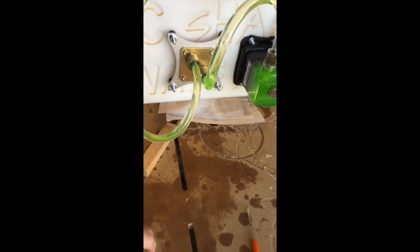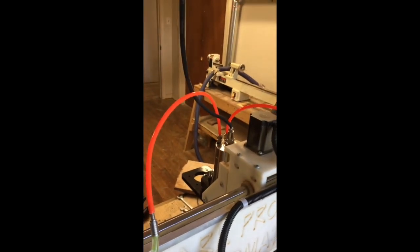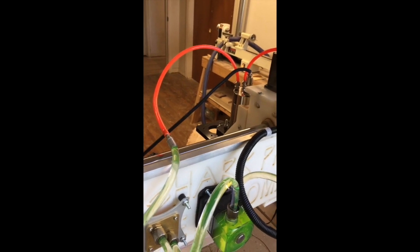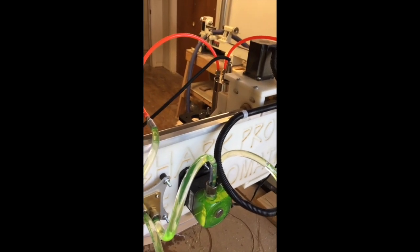The spindle motor is on and running at 23,000 RPM. I'll dress it up by hanging these two hoses with a bungee cord from a ceiling hook. Note that the spindle driver cord should not be bundled with the stepper motor cables because the spindle and stepper motors will interfere with each other. That's it — I'm going to clean it up a little bit and we'll start cutting some wood to test everything.